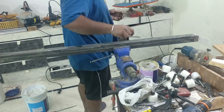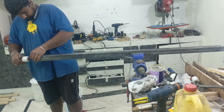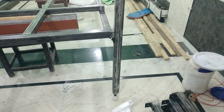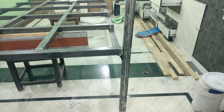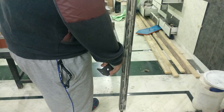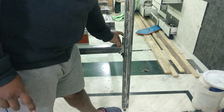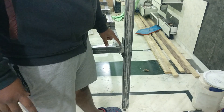I then start preparing the legs for assembly. First, I attach the L brackets to the top and insert the height adjuster onto the bottom side. But after attaching the leg to the mainframe, I found there is a lack of rigidity in the structure, mainly in the leg — this is because there is only one point of contact. To overcome that, I cut down some L brackets that are going to be attached to the leg and the top of the middle brace. This provides a lot more stiffness to the leg and also prevents it from turning side to side.